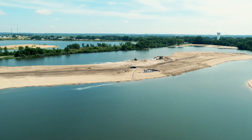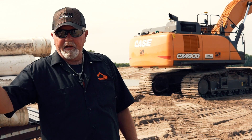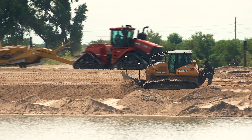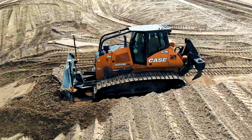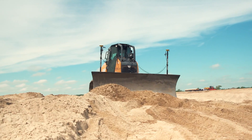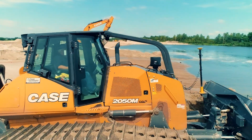These housing pads — we've got a front slope, top slope, back slope. I can come around here with the blade and as he's dumping with that 580, I can strike it right off to grade. I can define all my roads and we're on grade all the time. We don't have to have engineers out here putting stakes in. We're moving all the time.